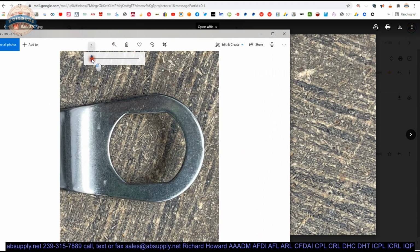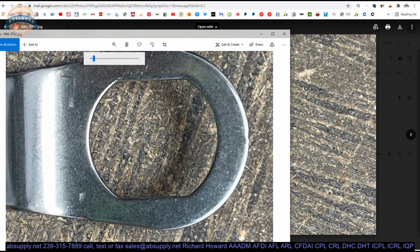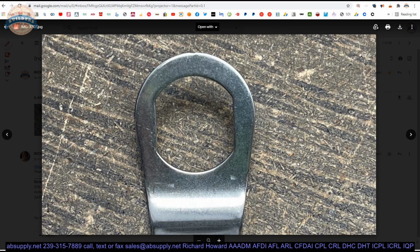If we were to take this image and then in your mind's eye simply imagine that we draw a horizontal line here. You've got the letter D on both sides. Very typical sort of installation in a metal cabinet, filing cabinet application, and there is actually a die for being able to make that prep in the filing cabinet drawers, in the face of those drawers. It's called the double D prep. It's like that so that the cam lock doesn't rotate or spin on you over time. Obviously doing this sort of prep in a wood application is not typical, but there's other hardware for that cam lock to prevent it from spinning.